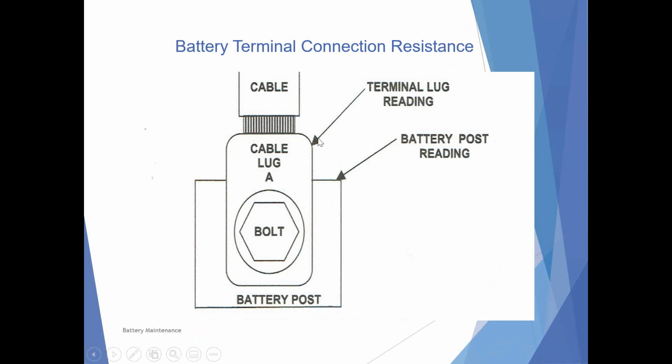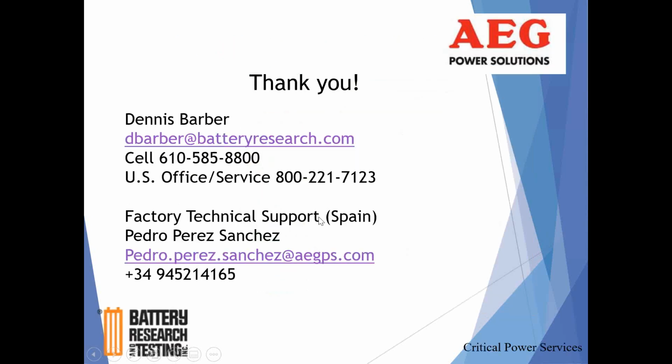This is also something else that Avangrid and NERC are big on monitoring: the most positive post of the battery string itself and the most negative post of the string itself, and the cables going over to the load or to the rectifier. Again, you remember these are all mechanically tied further down the line at the same point. So this lug here is tied to both the rectifier and the load, but you want to make sure that you have a good mating surface from jar number 1 and your cable, and jar number 92 and your cable going out. To do that, you actually need to measure the resistance between that lug and that post.